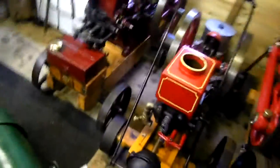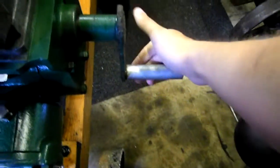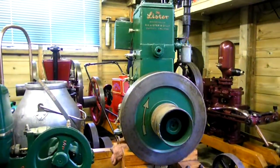Turn it back there — that's what this one runs like. So put it back to that way. Your handle is obviously down here; this one pulls back to you. Always put your thumb this side of the handle, not like that, because if it kicks back you lose your thumb. So make sure it does that. So I'll put you over here — hopefully start up in a minute, I'm praying it will.